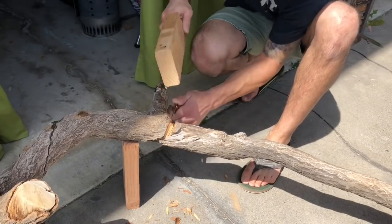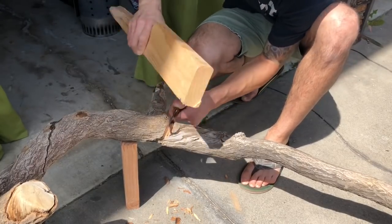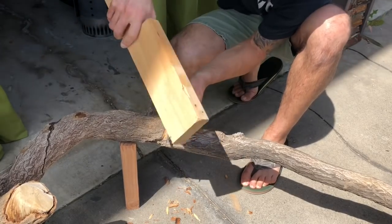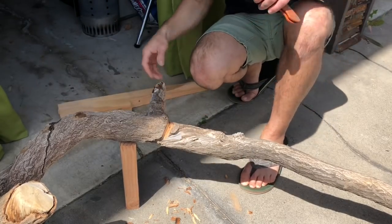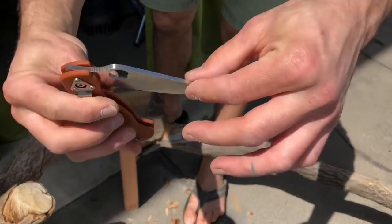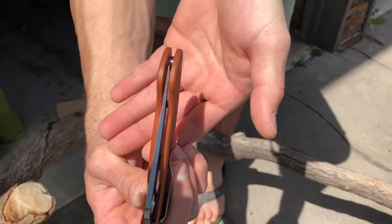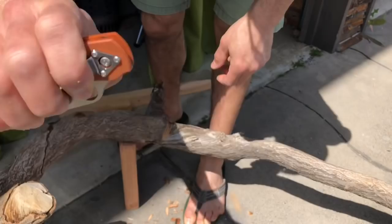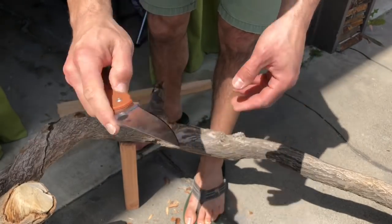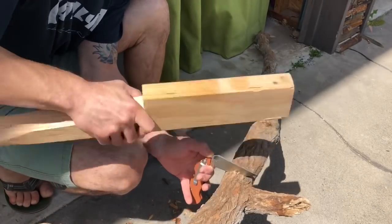Whereas Rex45, we can go all the way up into that 66 to 68 HRC, which is wow, guys. At 66 HRC, we're looking at probably a much better performing steel than even M4. In saying that, this example was found to be 66.3, I believe, and 66.4 on the second hit on the HRC tester. And wow, guys, it performed amazingly.